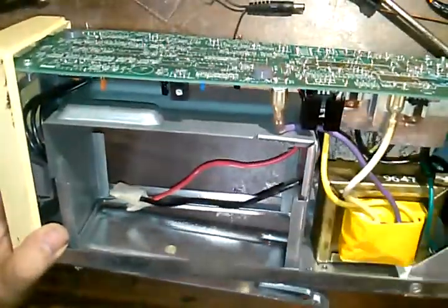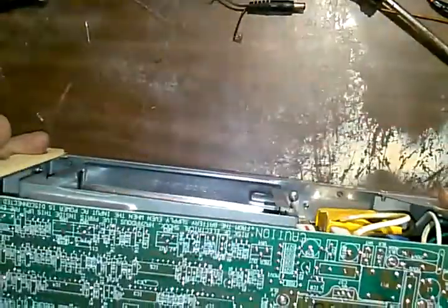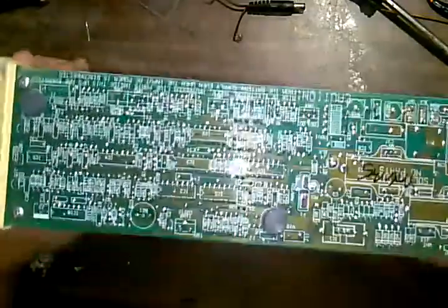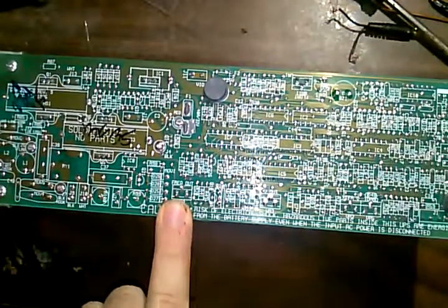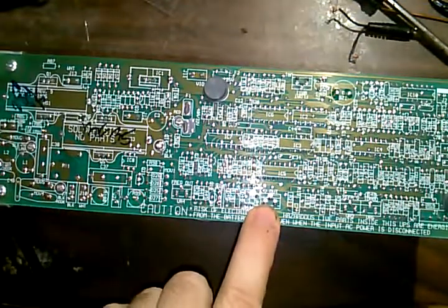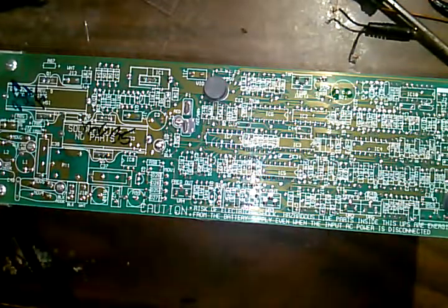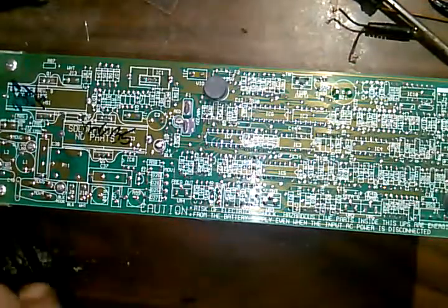Here's our FETs. Sense adjust, I believe, is what that would be. Float, it's the battery float adjustment. On this side, here's our frequency. We need to change the frequency. Voltage output. Transfer voltage. And the battery float. Okay, so that's that. The beeper went here in BZ1.